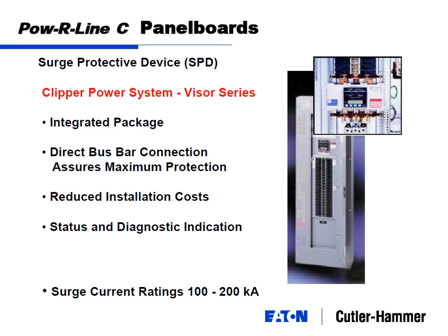And every time you add 1 inch and add 20 volts of let-through voltage, you decrease the performance of your SPD. So if you do need to mount it to the existing equipment, which we don't recommend, and you mount on the side, and you mount 2 feet of wire, 24 inches times 20 volts an inch is a little less than 500 volts of let-through. So all of a sudden your 400 volt let-through became an 800 or 900 volt let-through device. Just by thinking about it, it's not going to perform as well. It's going to do just as well on high transients, but it's probably going to let some of those lower transients get through.